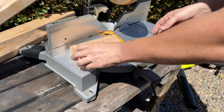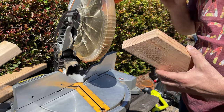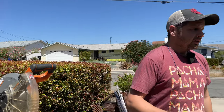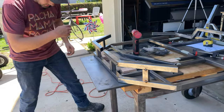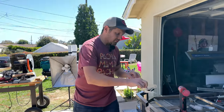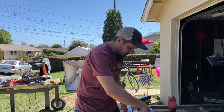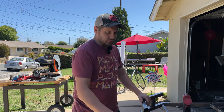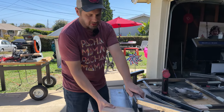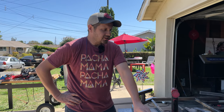Be sure to mark them — this is 22 and a half. Make your cut, then go over to your chop saw and set up the angles. You can also use the cut pieces as a reference or a standoff guide to hold certain pieces in place. Clamp it, get your angle right, and you're able to achieve a lot more precise angles.